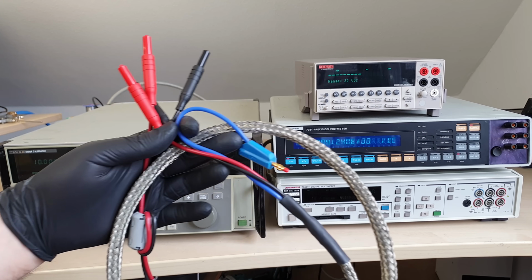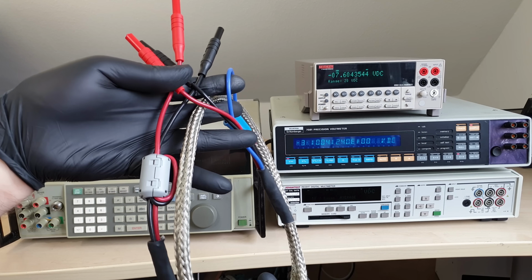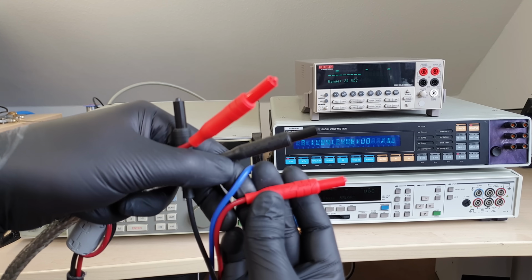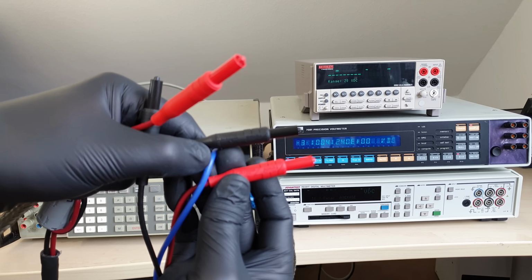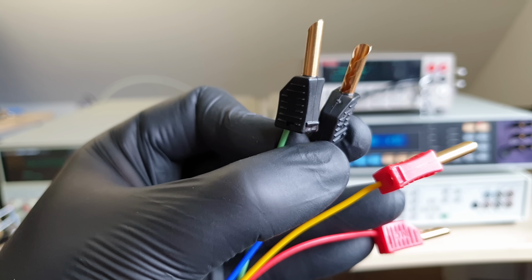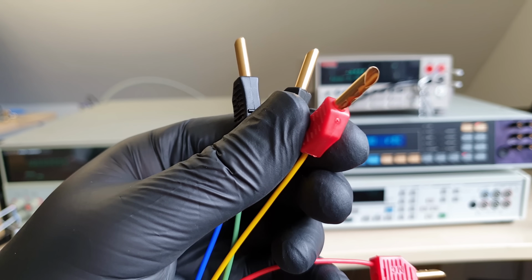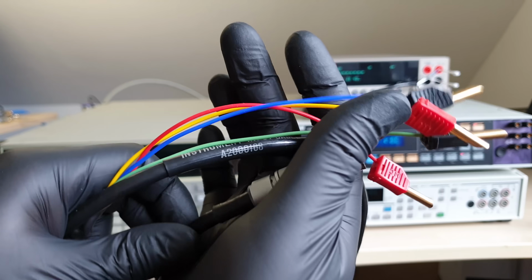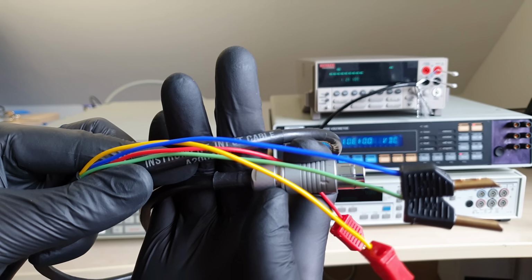Now for the voltage ranges, I do care about every last little nanovolt I can get, but somehow I've acquired yet another meter with recessed banana jacks, and I have only one pair of these Pomona low thermal test leads. Generally these hollow ones are also regarded as pretty good in the low thermal EMF department, but these happen to be attached to a Solartron input cable. Luckily I have another very reliable connector available.